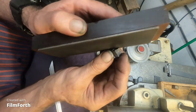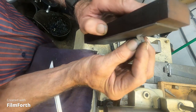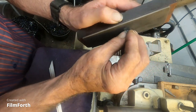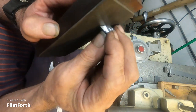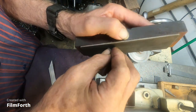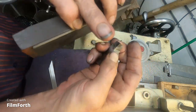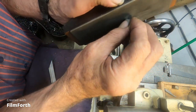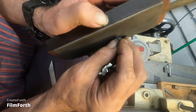See that — it's coming clean now. Then I start working the radius. I look at the edge of the carbide, get it on that stone, and start working. Carbide is more like concrete than metal. What I'm doing is working that radius in — I'm working the stone that way and I can feel the edge of it, plus I can see it as I start working that radius in. It doesn't take very long because the radius is so small.